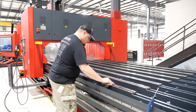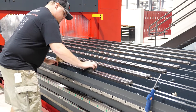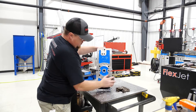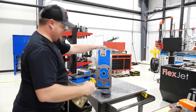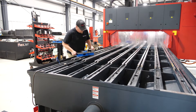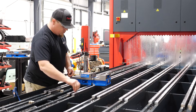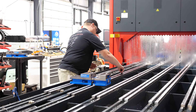What we're doing here is I'm just prepping the FlexCNC bed — this is our G-Series 2006. I'm going to put some vises up here on the machine bed. Really what I'm doing right now is just prepping the bed and the bottom of the vise, making sure everything's nice and clean. I typically run a stone across the table and the bottom of the vise to take care of any nicks or anything on the rails or the bottom of the vise to make sure everything's nice and smooth.